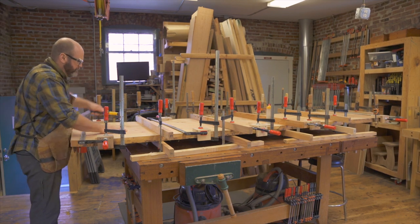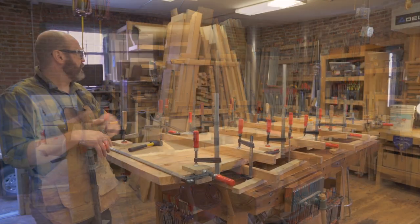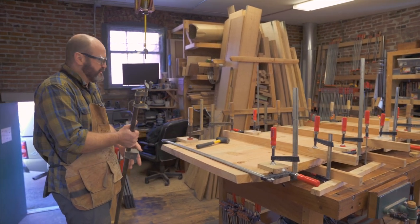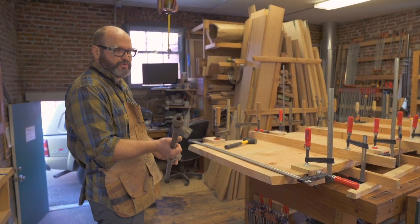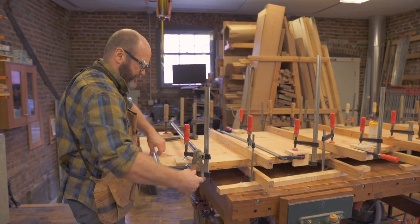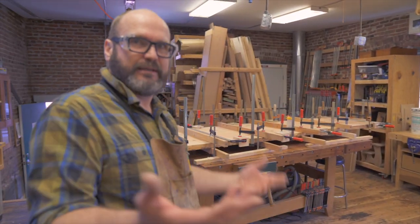You can see I'm almost done now. The other side of the table is already factory closed up. This side has still got a little bit of black lining giving me a few headaches. If I was real desperate to put more pressure on this, I could switch to these clamps — they're a better convincer with a lot more pounds per square inch of pressure. For big old headache slabs like this, it's worth doing — but for a more standard fine furniture glue-up with store-bought cherry and walnut, I wouldn't need this.